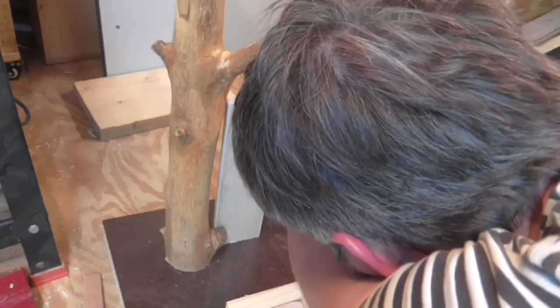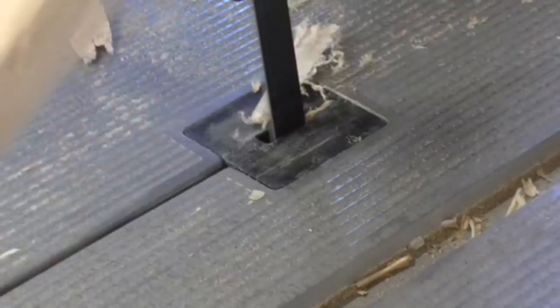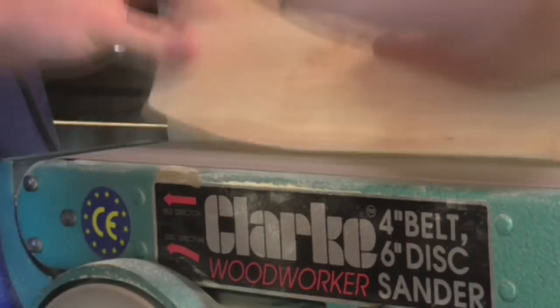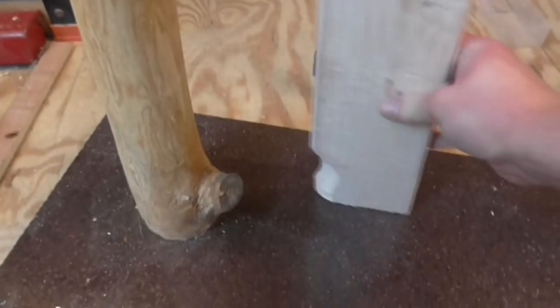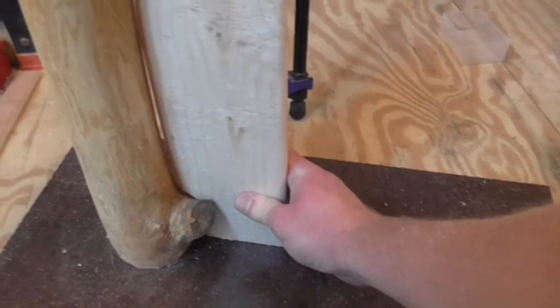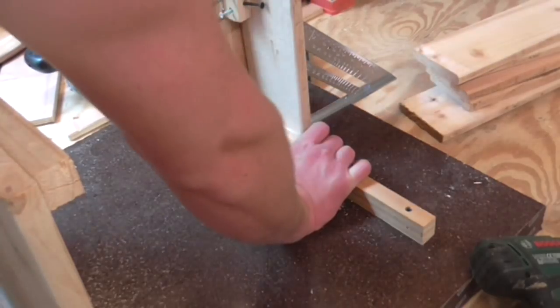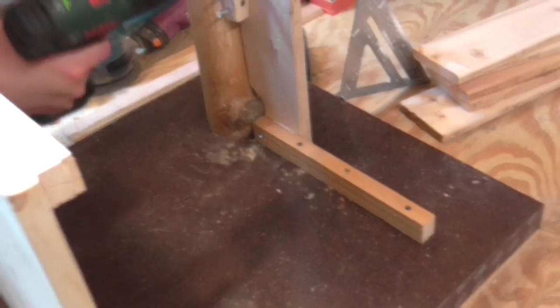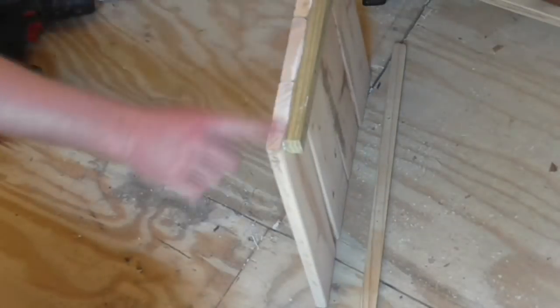For the other side of the wall I wanted it to fit around the log, so I roughly marked up the shape of the log with a pencil and used a combination of the bandsaw, a chisel, and the belt sander to carve out the shape in the wood. Eventually I was happy with the shape. I added another cleat and started to make the second wall. I also added a third cleat to secure this wall to the log, to make the whole structure even more rigid. I used a speed square to check the wall was at a perfect 90-degree angle to the base, then added the rest of the pieces to make the wall.